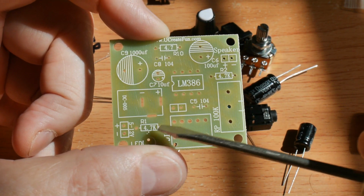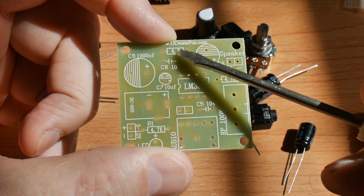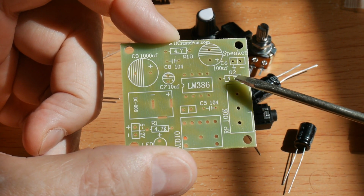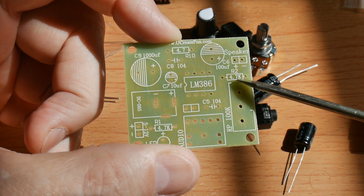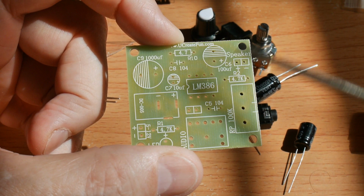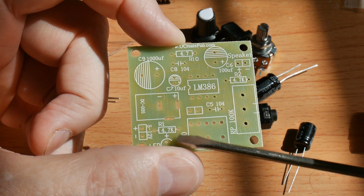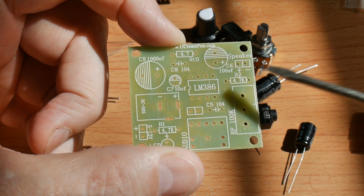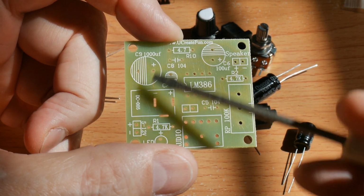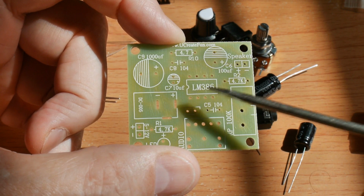Going with our strategy of the smallest, lowest pieces first, I'm going to place these 3 resistors. The first bit of artistry we're going to do is, when you have resistors like this, as you know, there's no polarization to resistors. They can go in either way. But I always like to align the tolerance bands to make sure they're on the same end. That adds a little bit to the eye. When you look at something, they're all lined up, they look better. Which end to choose? If there's a diode somewhere on the board, I will use the band on the diode to align the tolerance band on the resistors. Again, this is strictly for artistry. It's not technically necessary, but that's the way it works. So first I will go and place these resistors, and before I solder them, I'll come back and show you how I do that.